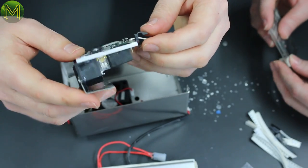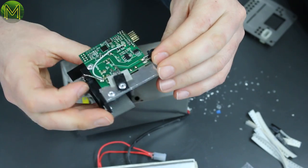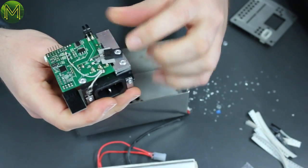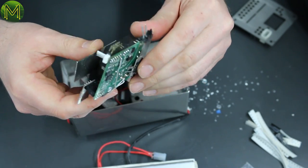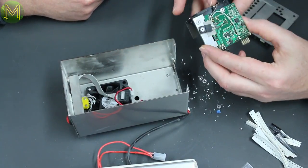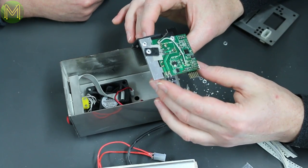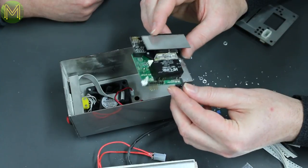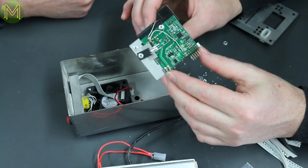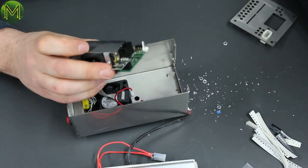But all that said, I don't think it's too bad. Yeah, I think if he started to go into proper production runs of this, he should look at improving things a bit more. Like, this is dodgy, having it like this. It does a job, doesn't it? So I haven't traced the AC signals, so I'm not quite clear whether that's safe the way he's got it, but it doesn't look incredibly bad. I've seen a lot worse. I like the separation. He's got a good separation there, going right through the middle of the optocoupler.